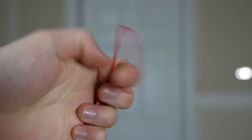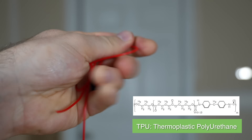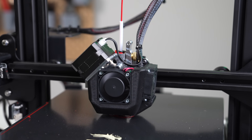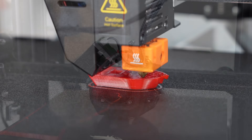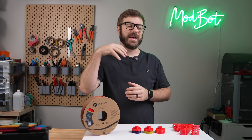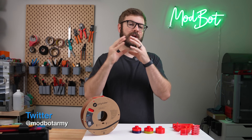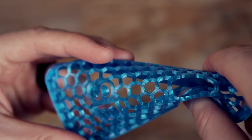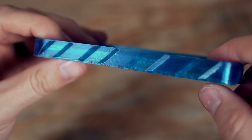There are a few different types of flexible filaments but the most common by far is TPU. Available in various shore hardnesses, this is a great material for printing functional parts. Although modern hardware has made flexible filament easier to extrude, printing overhangs and bridging is still no easy task. On top of that, TPU supports with TPU is a great way to form a very messy bond that you're not likely to ever get undone, which does greatly limit the models you can print with TPU.